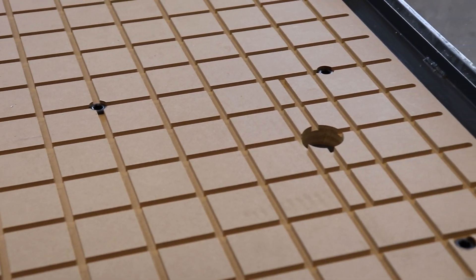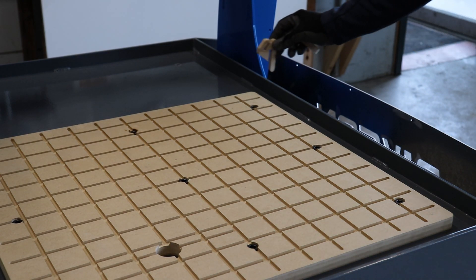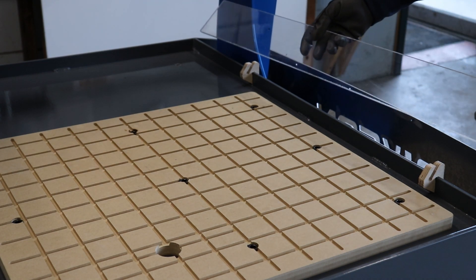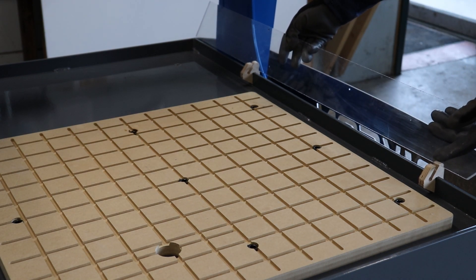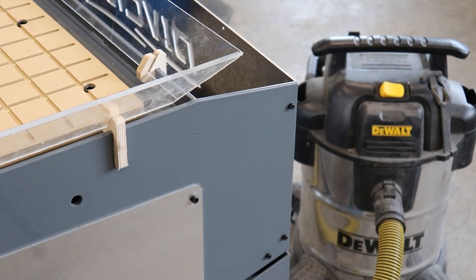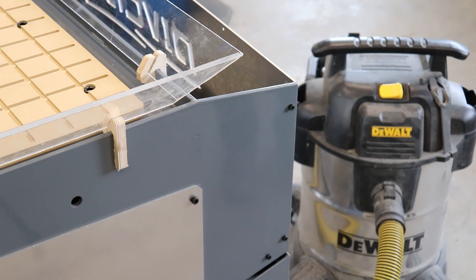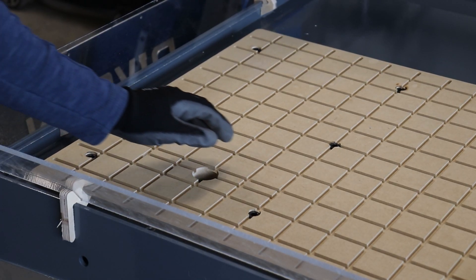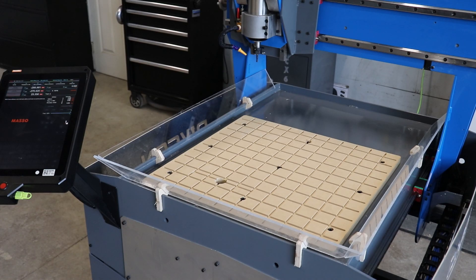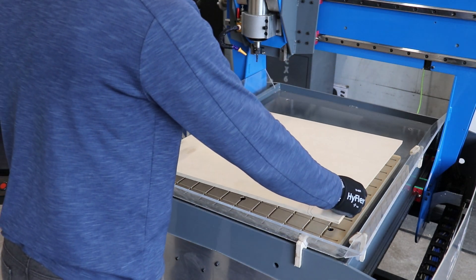The top is easily reproducible and of inexpensive material, so we can treat it like a spoil board and simply make a new one when it's worn out. We also made up some simple containment guards from some plexi and little wood pieces before we sort out a dust collection system. Once it's all mounted with some M8 fasteners, we can fire up the shop vac to see if it holds. I've always wanted to try this out, and I'm not sure it would work with all materials, and it may not be great for the shop vac, but there may be times when this is a handy little option for quick sheet cuts. We're going to test it out with some ⅜-inch MDF sheet and prepare for our first cut.